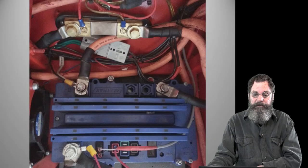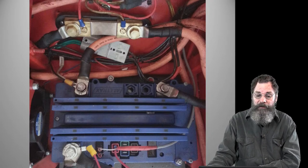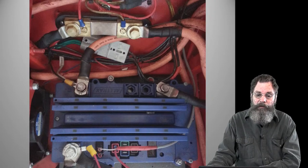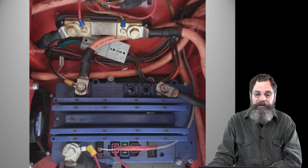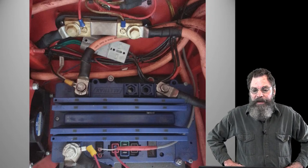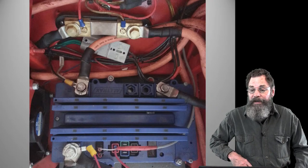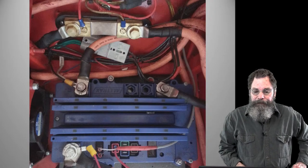On the right side of the control shelf, there's the controller itself, which I said is sort of the brain of the throttle and tells the motor what to do. And then directly above that is that little smaller quick disconnect in gray, tilted at a little angle, where the smaller cable's coming out. And then right above that, where the heavy cables are at the very top, that's our shunt.